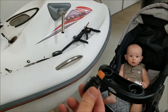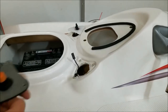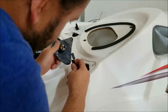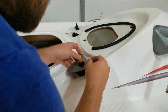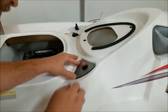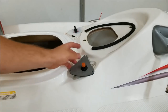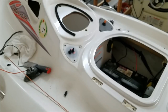I ran my switch array in. When you go to high, it pulls from the 24-volt wire. Low, it pulls from the 12-volt wire. Then I connected the motor to the center two pins on this switch. New safety switch is installed. Memory serves me correctly - this gets connected to the M terminals. And it's broken. Maybe I'll glue it in or make a new one. I'll leave it for now. I'm going to screw the circuit breaker back together and see what I can fix about the little chip that just broke off.